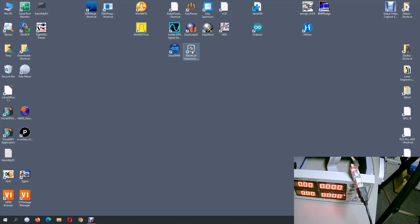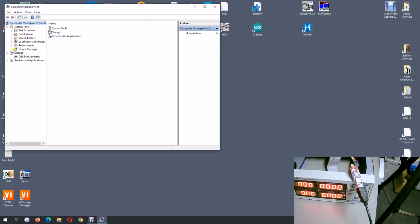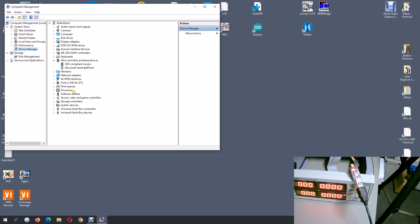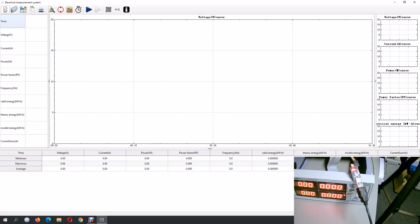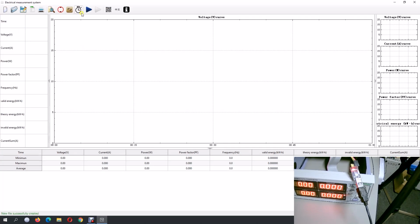And I downloaded that software that you just install. I checked my new USB device in the device manager, it is COM3, that one came extra. So if I open this software, I need to do first new file, then I say search for device, it is COM3, the PM99 series, and do the detection, and then you should see the communication start, and it does.